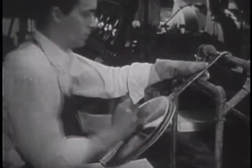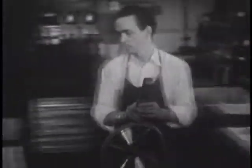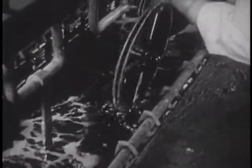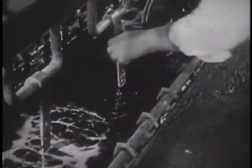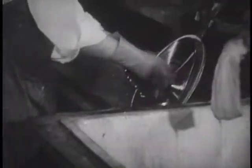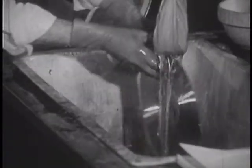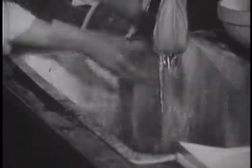Before the stamper is ready to use, it receives a nickel plating and then another coat, this time of hard gleaming chromium, to give it resistance enough to last through many pressings. The matrix is washed once more, and now with other stampers, it will soon be ready to press the finished records.